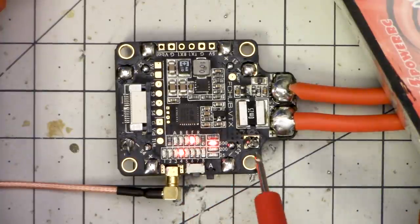I can also see nice little LEDs here — everything seems to be working right. The next thing I did was hook up the flight controller. When I did that and plugged the battery in, nothing powered up — not the flight controller and not the video transmitter either. That's pretty weird because I know the video transmitter was working correctly. And that leads us to this really fascinating troubleshoot: what could cause the whole system to act like there's no power getting to it when you plug in a new component?